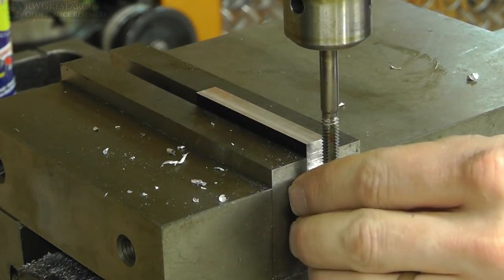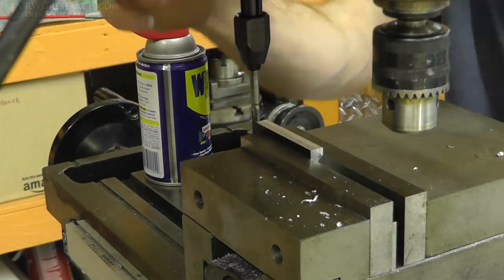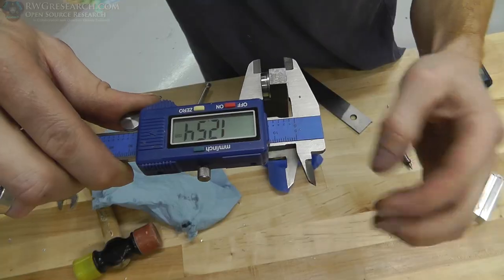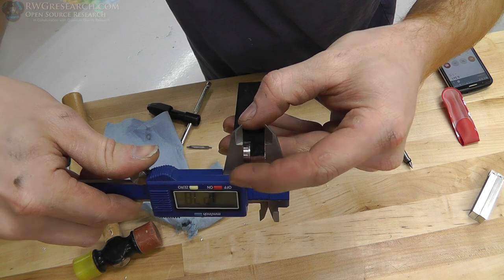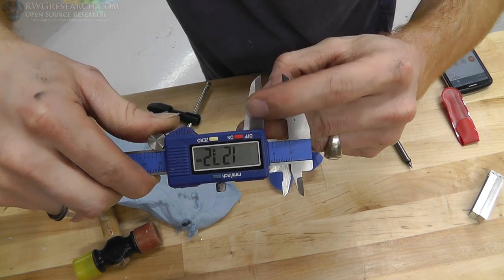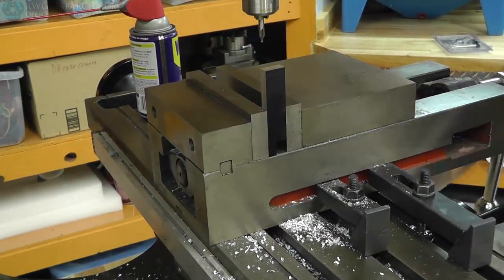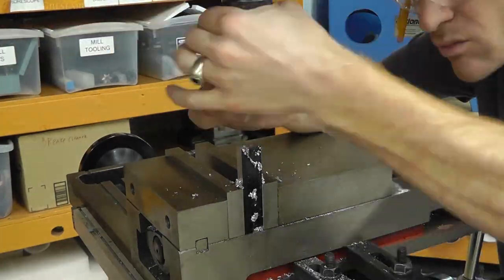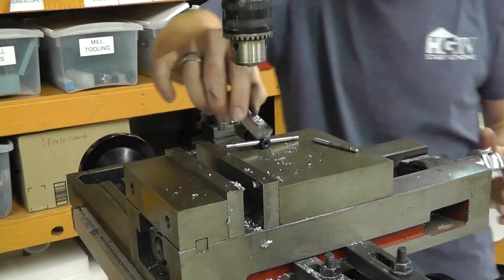This is the way I do threading. I put it in the drill press or vice and just lightly tighten it. I was using WD-40 here because I didn't have the tap magic at the time. I just lightly get it going to get it started square. I usually loosen it just enough so where it slips once it gets going; then you can take it out and it's square. This is how I usually tap holes on the milling machine. I do not like to power tap — I just don't trust it. So I usually start it like that and then finish it with a hand tap. This seemed to work pretty good; the WD-40 worked fine. I then took measurements to see exactly where I want to drill the bottom holes. The bottom holes need to be drilled and threaded. Using a center drill, a regular drill, then a tap, I threaded them as deep as I possibly could because I wanted to have as many threads inside that aluminum as possible.